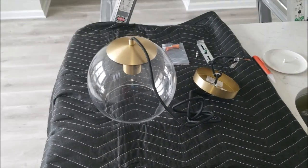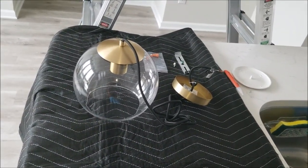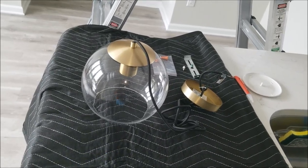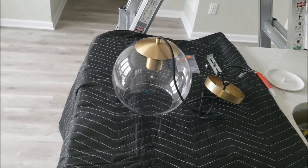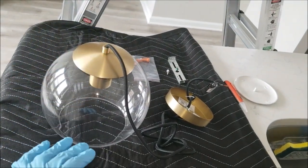From here, go back and turn off the power from the breaker, make sure it's off, confirm it's off, and continue on with the install. Usually I'll lay out a work area right below where I'm going to install the light — I put something soft down, like a blanket or a moving rug, just in case I drop something like this pendant, so there's less of a chance that it will break.